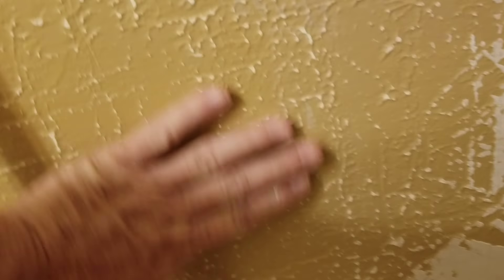Then what we're going to do is start mudding it. So this here is how it looks with one coat on it. The whole idea of knocking it down — taking the points off — is to prevent as much roughness as you can, so when you put a coat of mud on it's as smooth as it can be, and then when you put the next coat on it'll smooth it out even more and should be sandable.